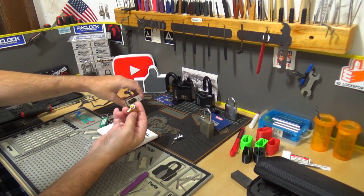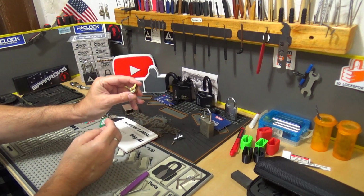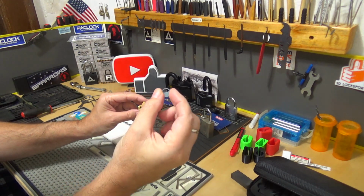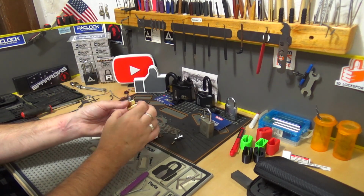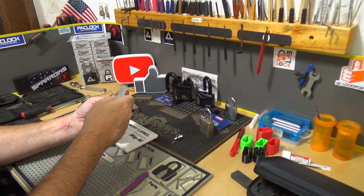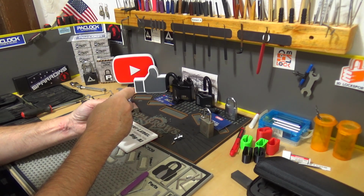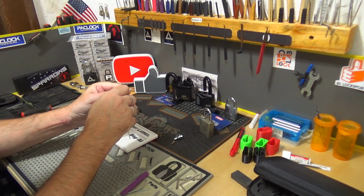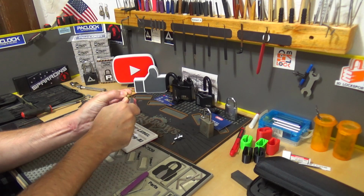Nice. And it does not need an anti-bypass wafer because the lobe is going against the keyway. In other words, it does not need one of these because you can't bypass it anyways. So let's see, it's still in the open position. Let's see if we can get that clip off of there while it's still open. Maybe save us a minute or two. Yeah, that's not going to cooperate too good. Let's see if we can yank it. There we go.